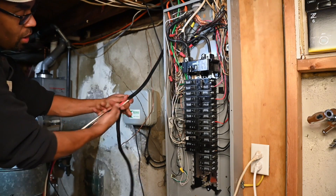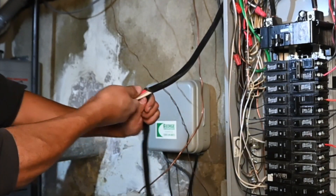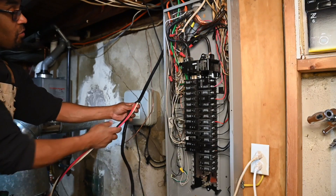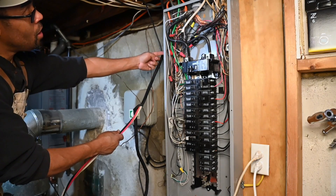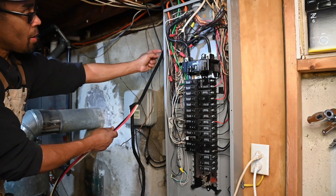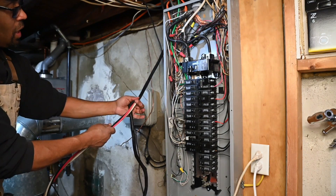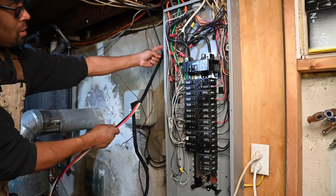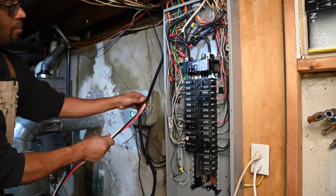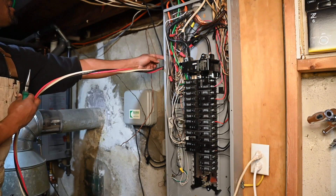Once your wires are stripped, just hold one end down and pull it — it'll split open exposing the wires. I need to take my wire up to this point here and punch out the tab. When you see your box there are little tabs you punch out. I'm going to take this sheathing up to that point and stop it, so the sheathing stays intact outside the box and then splits off with the wires exposed to go inside. Now I'm going to shut off the power so I don't shock myself.